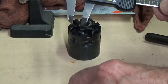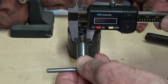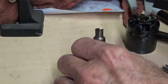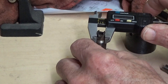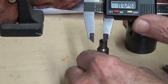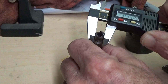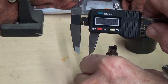If the wrench is much smaller, it'll decrease the strength of the ears, allowing them to bend and making it easier for the wrench to slip off the nipples. I have one that I made that has the correct barrel diameter, but has the ears flare back some, making it unable to fit into that recess. It still works, but I wouldn't want to use it on tough jobs. If this section that fits the nipple happens to get bent out, it won't fit into the recess, and it'll also have a tendency to rise up and round the nipple corners.